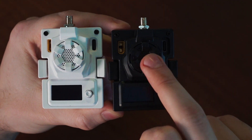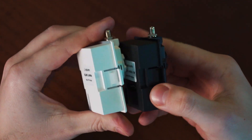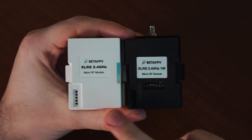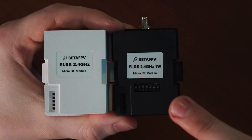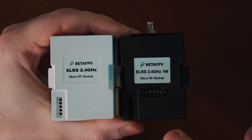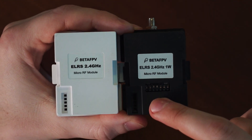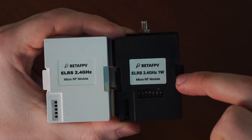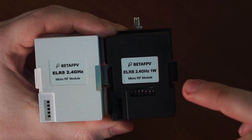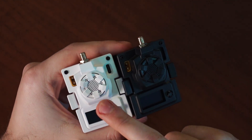Taking a look at the side it's pretty much the same, but at the back you can see a new difference - here on the white one you have only the pins, but here on the black one you have the pins and also DIP switches. These DIP switches perform different functions: 2 and 4 up is regular operation, hold down only 1 and 2 up is for updating the firmware, and hold down with only the last 3 up is for updating the backpack function. And this is another difference - this one supports backpack, this one does not.